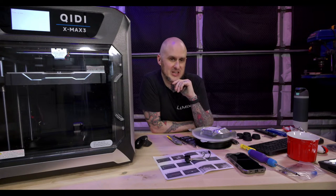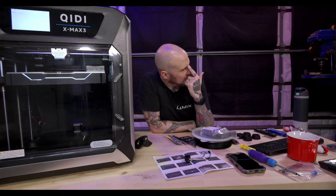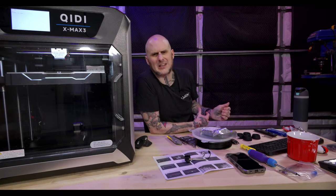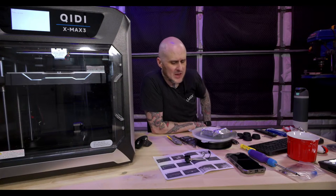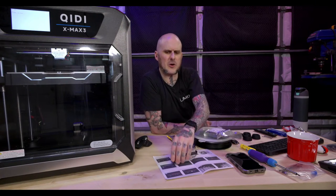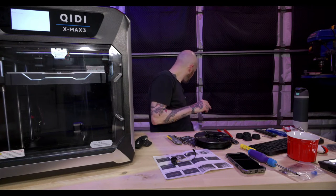Trident is a less finicky build. Yeah, like, quad gantry leveling is just kind of annoying. Having to do quad gantry leveling all the time. Working with my 2.4 of last week, my clicky probe is acting up right now. So I just finished today a design for an update where I'm going to run clicky PCB. And clicky probe worked out. It was acting up, so quad gantry leveling was being a pain, and you have to do it before every print, you know?